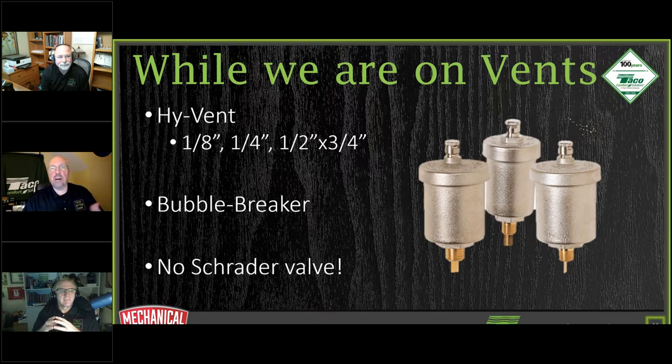And I'm going to hope it dries up and goes away. Why is it dripping now? Well, that Schrader valve isn't seated properly. It didn't get a good seat, because the surface right at the top of this cap is where all the crap that floats in our water is going to end up. It's going to end up here. And sometimes it's going to foul up the mechanisms that we have in here. So I've taken mine apart so we can really pay attention and see what's going on in here.